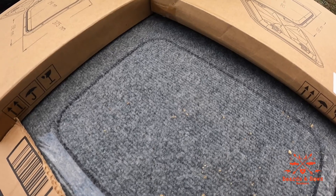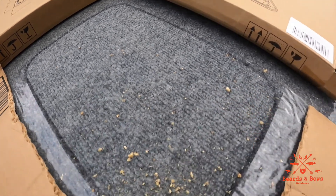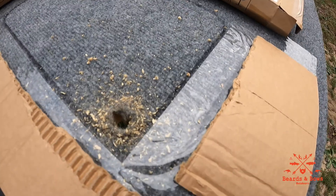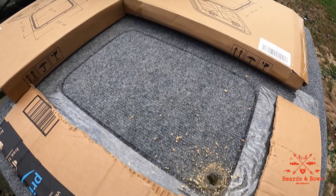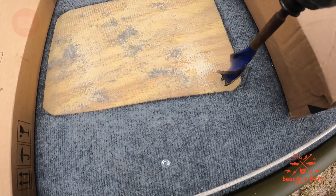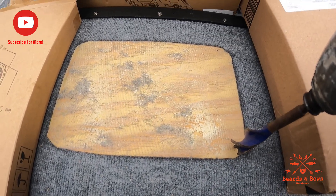For this video you won't see me with tape around the lines, which I just now came up with — if you add tape just outside of that line, it makes shop vac cleanup of little pieces a lot easier. What you're gonna do is take a drill bit and drill through one of these corners, and then you're gonna sawzall it out.